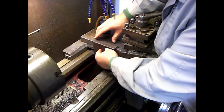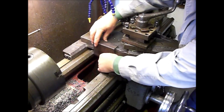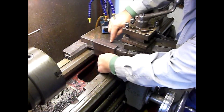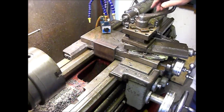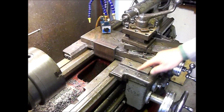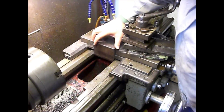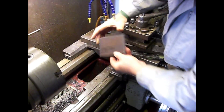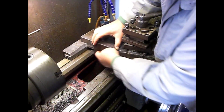There it is. Then I'll lift it a little, two or three millimeters, so it clears the cross slide. It shouldn't be fastened on the cross slide. Maybe I wasn't clear enough, but of course it should be fastened to the saddle. And I think the cast piece here has this radii, and I think I'll do that on this piece too.